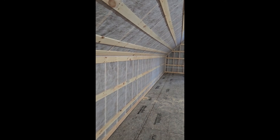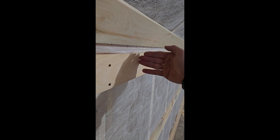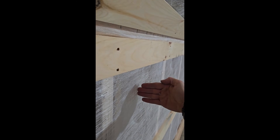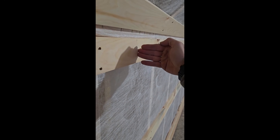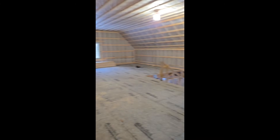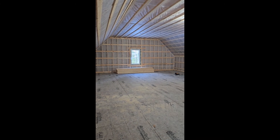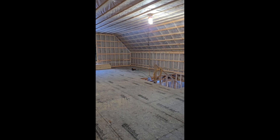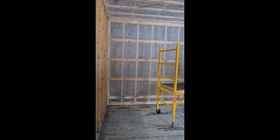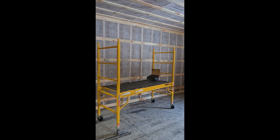The interior walls end up intersecting with the strapping instead of the framing, so you don't get a bunch of extra framing where the interior wall intersects — there's more room for insulation and the interior wall can just attach to the strapping. The next step up here is to start framing those interior walls. In the next video I'm going to do a mid-construction blower door test and the results were pretty good, so I'm excited to show that.